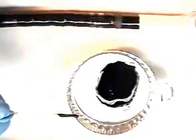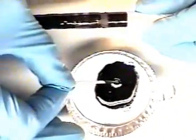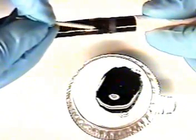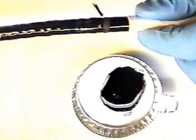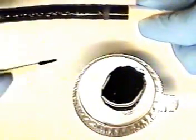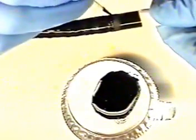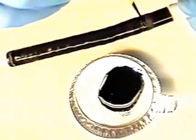We will now apply glue to our bending rubber sheath. First step is to take small amounts of our bending rubber sheath epoxy and fill in the gap first initially between the insertion tube and the bending rubber. Fill in this gap with your epoxy. Turn the endoscope over if necessary in order to fill in the entire diameter with epoxy.